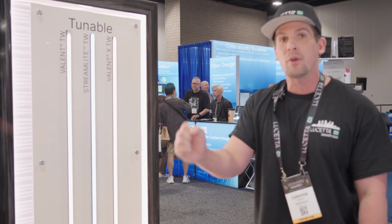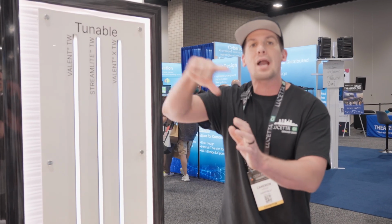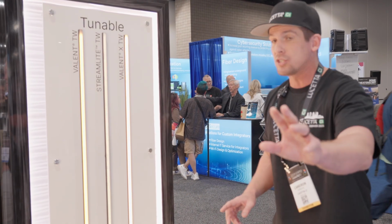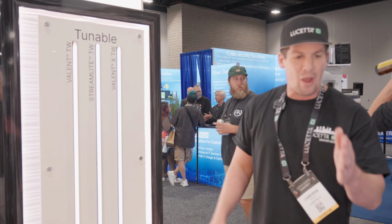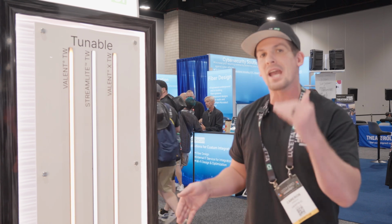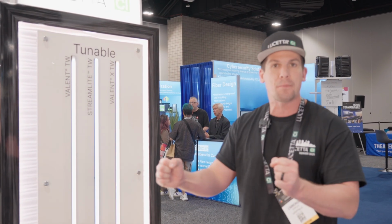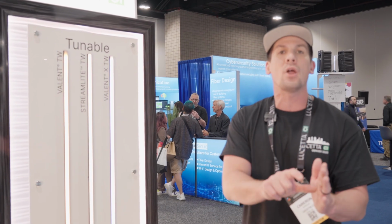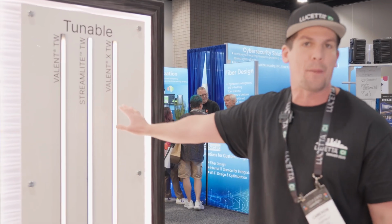So the third chip is what we call an anchor chip. And now this allows you to sit on that beautiful black body curve as you tune the CCT through the entire range. What this does for you is 2 things. It gives you the longest CCT range in all of tape light, so 1800 Kelvin all the way up to 6500 Kelvin, but it also gives you the highest CRI across all of the CCTs. 98 CRI at the 3 chips, so 18K, 35K, and 65K, and then about 95 plus through all of the other CCT ranges. Definitely come check this out. It's one of the most beautiful tunable white products out there.